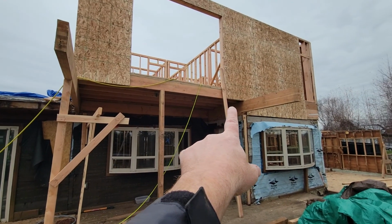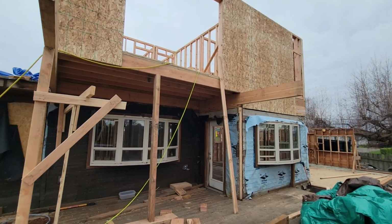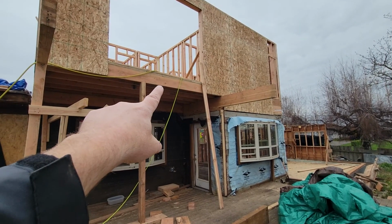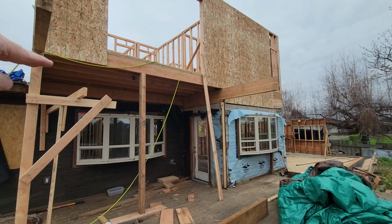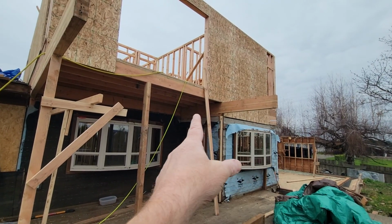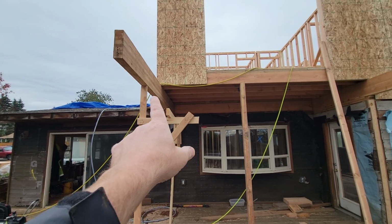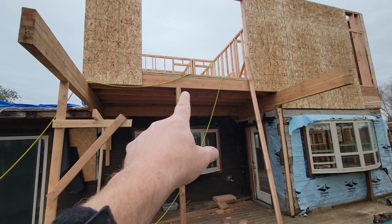But we need to replace this with something else. I think that you called out 10-inch because then it'll be the same size as the other floor joists, so we can have a flat ceiling in there that is wrapped up. I'm happy. Also, it's resting on top of these big beams. You called out the two big beams. So there's no such thing as an 8x10 for that spot right there.